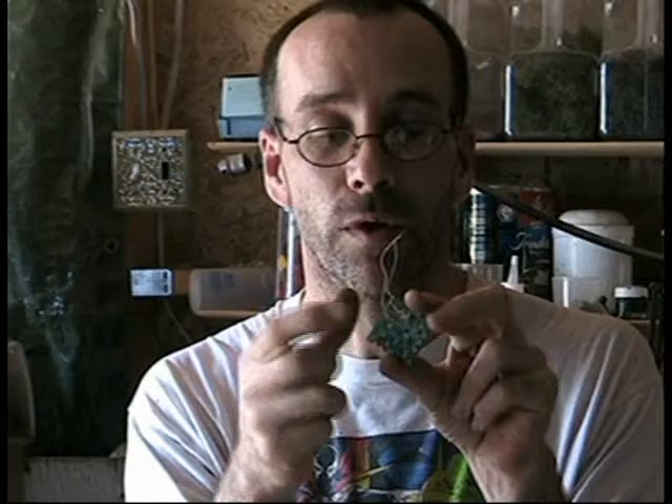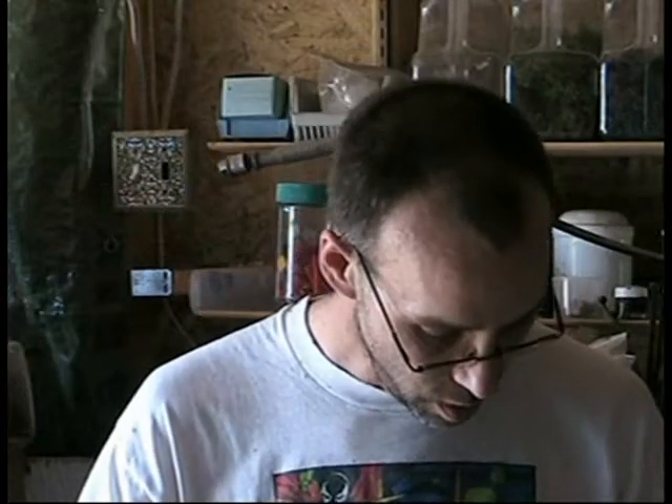If you want to do a whole bunch of testing, grab yourself a little piece of circuit board out of something. Lots of hobby places will have little pieces of circuit board. I bought a bunch of templates and I just snap off little pieces and solder in resistors where I need to. Then I have this on a bench table and I can just take LEDs and set them in there to see if they work. Use a 1K ohm on there.